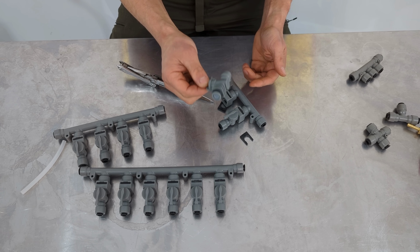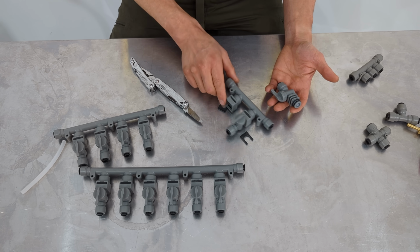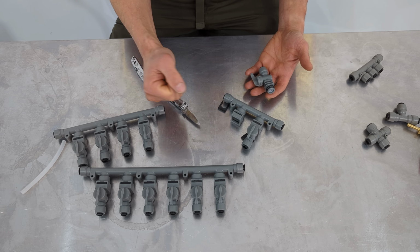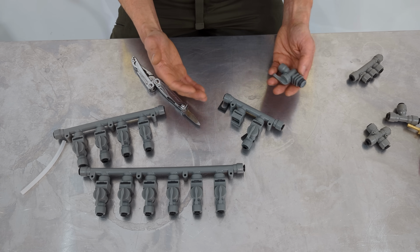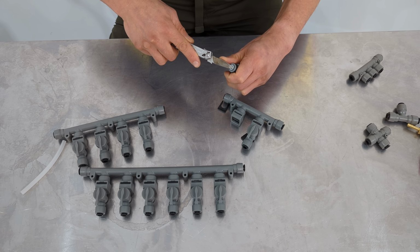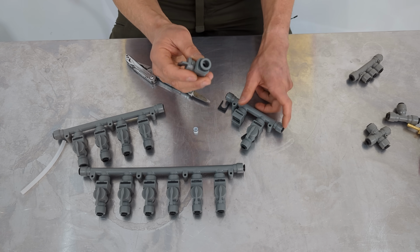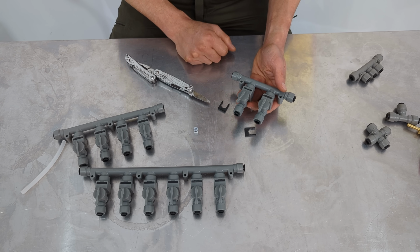And the other thing is you could swap out these fittings if you really needed to, or you could take the check valves out. So for instance, let's say there's a reason why you wanted to have no check valves in these. Some people, for instance, don't like when they accidentally turn their regulator pressure up too high and then turn it back down and pull the PRV on the regulator, it doesn't release all the pressure in the kegs. Now there's pros and cons to that, but if you're a newbie, you might find that pretty confusing. Well, if you find that confusing, you can just remove this check valve just by simply using a screwdriver like that and popping out the check valve. So this check valve is a replaceable and cleanable part just like that, and it just comes straight out. So now if I put this back in there, this one here will have no check valve attached. So gas will flow in both directions through this valve here.